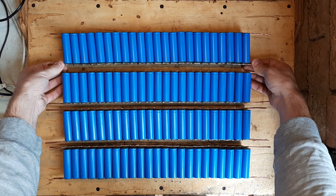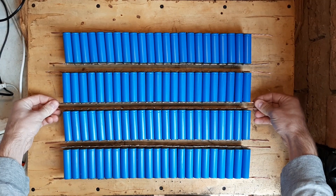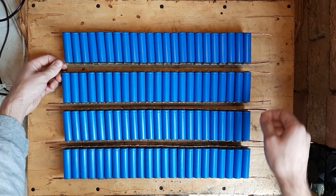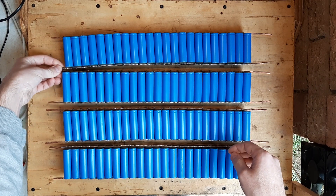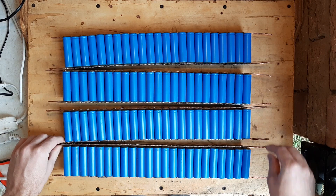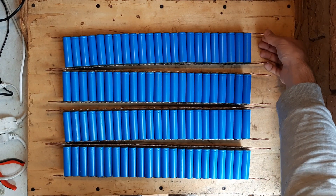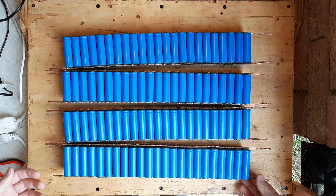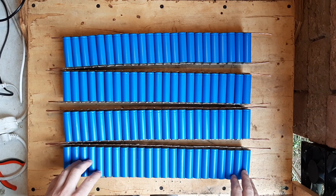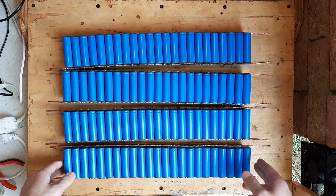Thicker busbars will definitely reduce voltage drop, but it will not solve the problem if you were to connect on both sides to connect these packs in series. You will still have to connect this side and that side — connect them there to complete the connection, and complete that there. From here, this negative you go to the next positive of the next row of packs. This can be your main positive and this your main negative for this 4S 12.8V pack. Then repeat it four times and we get to almost 52V for this pack.